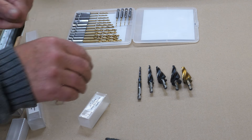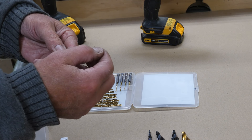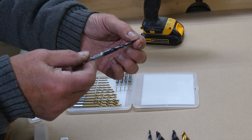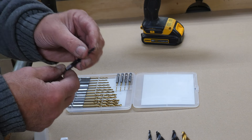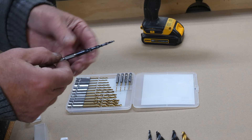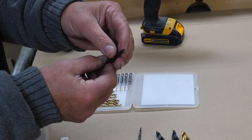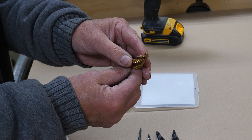What these are used for: you drill your initial hole — in this case it would be an eighth — and then you can just step up through the different sizes. This one is handy because it basically drills a pilot hole for you, and then you can size on up if you've got something that's tricky. Another good plus is these have a 135-degree split point, which means when you go to start drilling your hole, it isn't going to start walking around, so you don't necessarily need to use a center punch.